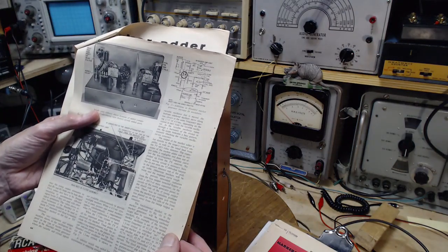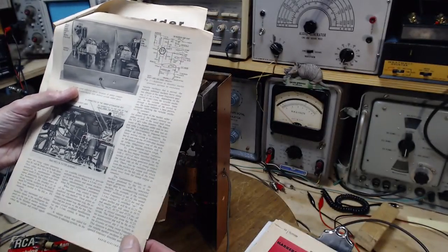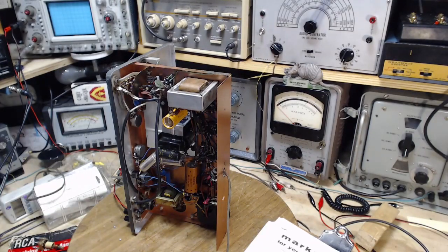I have to start doing this in a television set, and there are quite a number of traps also. And part of the difficulty in doing an alignment is having your alignment signal trapped at some point when you don't want it trapped away and diminished.